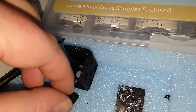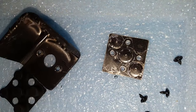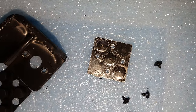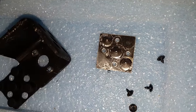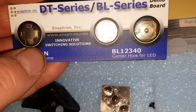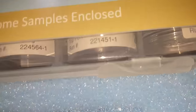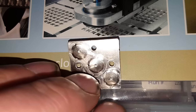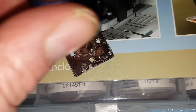What it pushes down onto is the aluminum plate. As we know, only three of the tactile switches on the fidget make noise — the other two are silent. What they've actually done is used tactile domes like I showed you from the Snaptron demo board. These are identical — slightly bigger, but the same tactile domes. They've got a sticky surface over the top of them and they sit onto the aluminum plate, and that's where we get that tactile noise from.